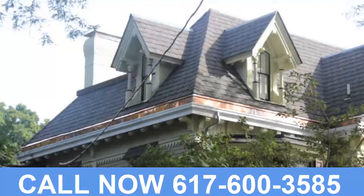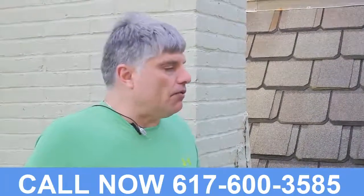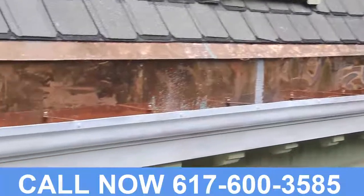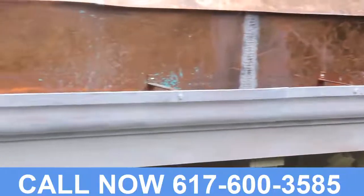We're finishing up a house circa 1850. This house formerly had a very large wooden gutter system, and it was installed in the traditional method called the split fascia system — something we've discussed briefly in one of these videos. Essentially, that means the gutter was attached to the rafter tails.